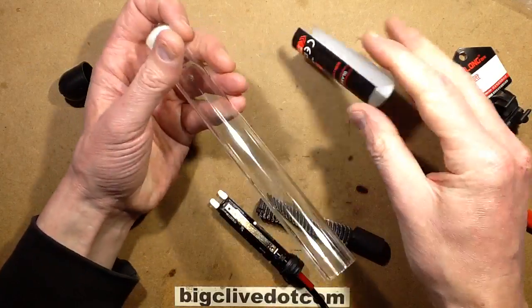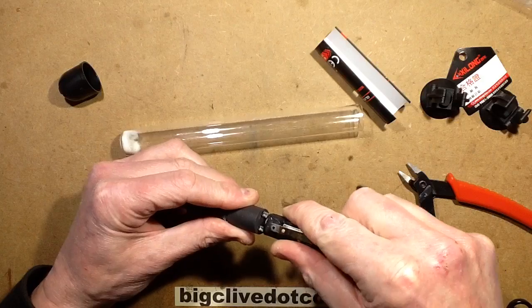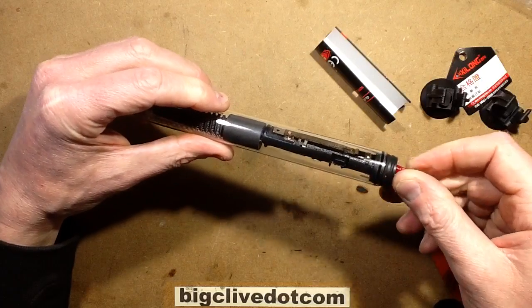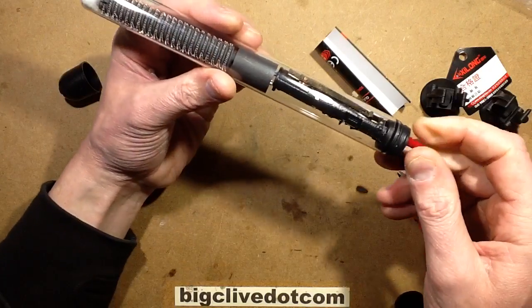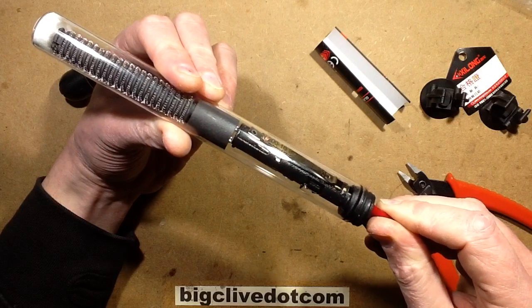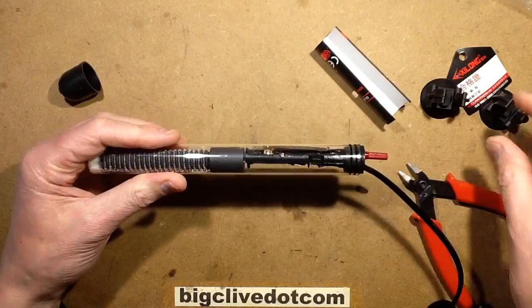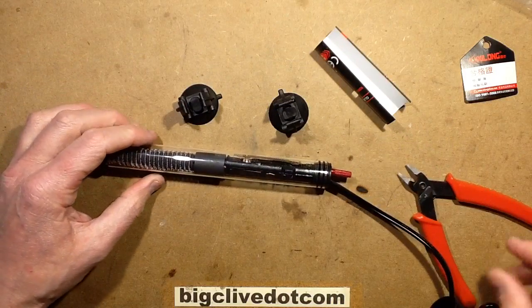I almost kind of like the idea of it without the paper — let's see what it looks like. So let's push this into its little spade terminals — much easier to go in than it is to get it out — and slide that back in. I think that looks nicer. I think I've put that on the wrong way around. The bimetallic strip is actually clapping against the side of the glass, which makes it a bit louder, but I think that's okay — that might be what it's designed to do, just to limit its movement. It certainly clears the contact well enough. It's interesting, it's nice, it's easy enough to open and get into, and it's what you'd expect — a thermostat heater. It comes with these little rubber suction cups for mounting it in the tank, but as a source of components it's actually quite interesting and a useful little device.